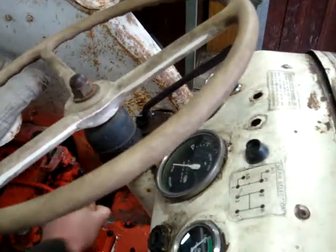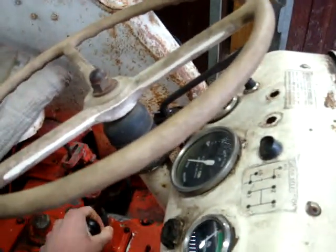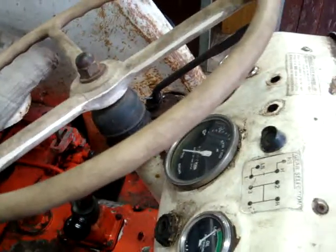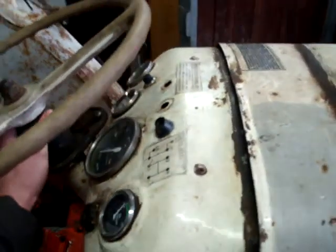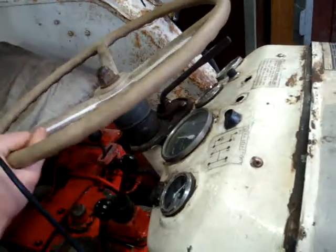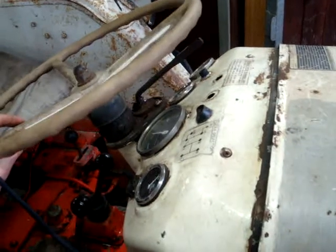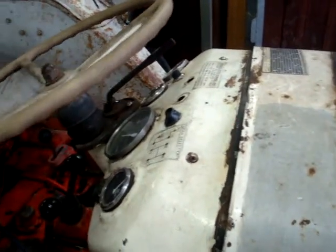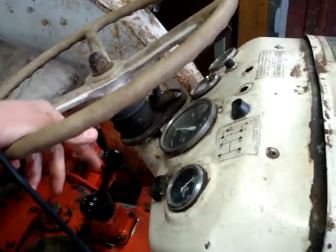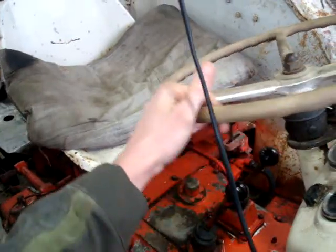When I was blasting the other day, I was just doing plastics, and just so the compressor doesn't get too hot, I was running it in the 540 selector for the PTO, not actually 540 RPM, and the engine was running at about 1300 RPM, so it'll be only a few hundred RPM that the compressor was running at. But what was quite pleasing was that it was taking the paint off nicely. I tried it on a part on my tractor that I'm restoring, and it stripped it back to bare metal in seconds. So hopefully I shouldn't need to run it at 1,000, which would be running it at 540 RPM, that's where I have it set. That's what I'd need, but I don't think I will need that now.